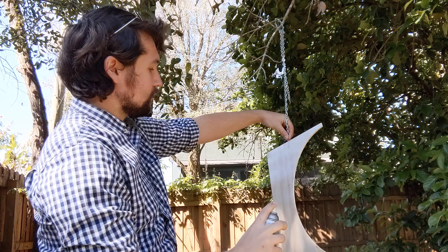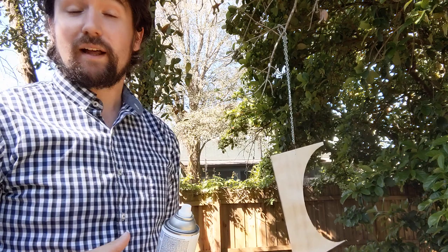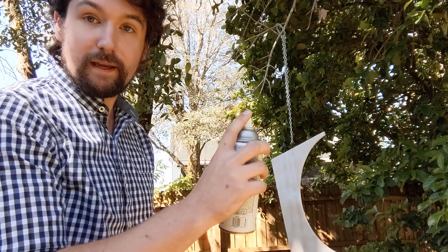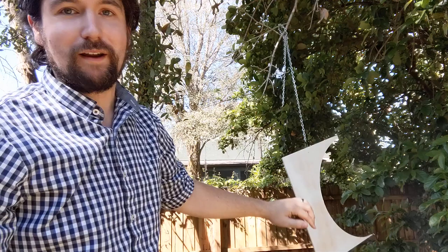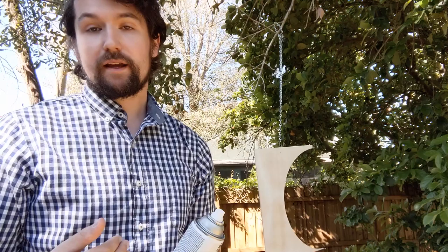I'm going to start off the work piece and do my little passes. There we go — that's my first coat. You notice how it is kind of blotchy because we only had the first one in, and that primer coat tends to soak into the surface especially if it's wood, but that's okay. I'll do a second mini coat going in a different direction — vertical passes this time. It's been in there a lot; I should use two chains next time. So I have two small passes there, one horizontal and one vertical, so we don't have too much overlap or waves and ripples in the paint.